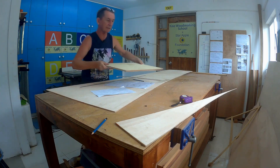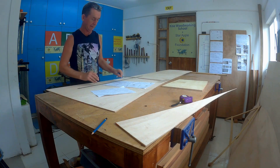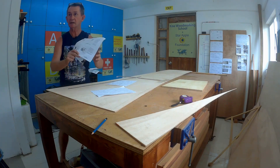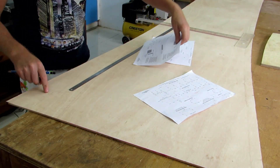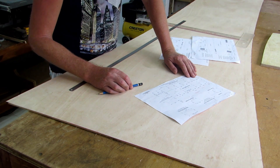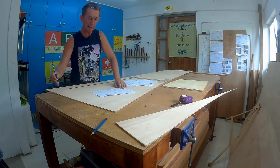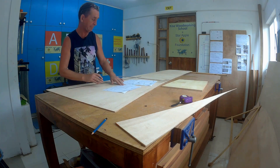We will do the whole bottom — the front of the whole bottom — so our forward part is coming out of a different sheet, the one that the two sides were on. That's the way it's been laid out and that's the way we're doing it. It says in the drawings to make this section oversize and trim to size. It's 520 and it's 155 by 155 exact on the end where it's joining on. So on the sides I'll leave it the correct size but I will make it longer this way — oversized towards the front where it's going up to the stem. It doesn't say by how much but there's a picture showing it.